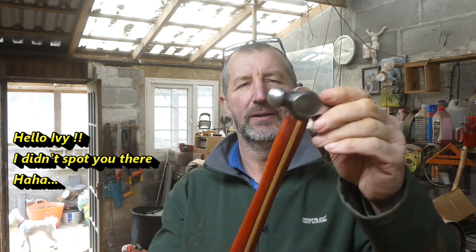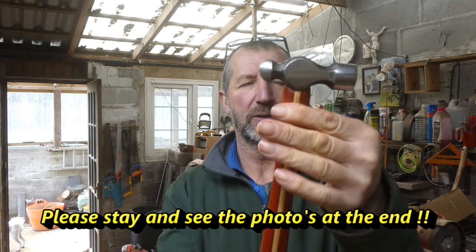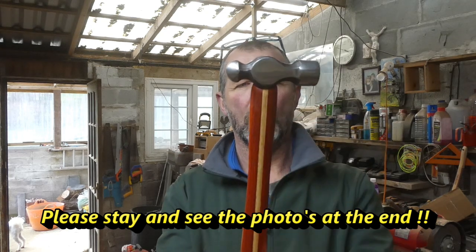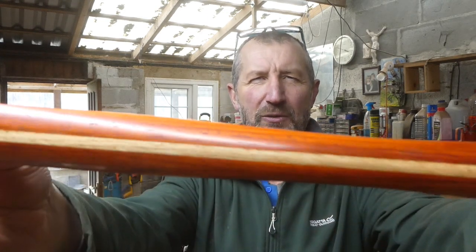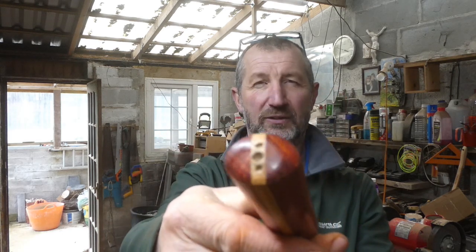So there you have it — one ball peen hammer, restored. Polished the head up and put a new handle on it — a bit of a fancy handle. Nice and slim, and it's sort of an oval shape which I did on the lathe, and it's got a slice of oak running through the middle of it just to give it a bit of interest. It doesn't need it but it's just a bit of a novelty. But a really nice finish on it. You can still see the holes on the end but I'll not bother with those because it's a hammer at the end of the day. Yeah, it all finished off really nice, and this is probably something that I'll use — it's a nice thing to have.